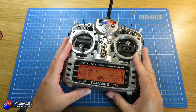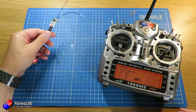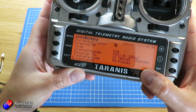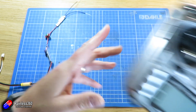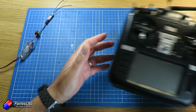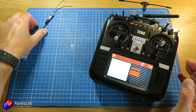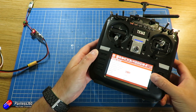Here we are on the bench — let me show you this in action. I have my Taranis set up and bound to a little receiver. I have to be careful not to get too close otherwise it will drop out. So there's a little green light — we are connected, bound to it in D16 mode, and we have a receiver ID of 01. For this to work, the receiver ID needs to be the same. In D8 there aren't any receiver numbers, but if you're using D16 we're going to have to remember that — receiver ID 01. I've turned the Taranis off, so let's get our RadioMaster TX16S, power it up, and go into the model memory.